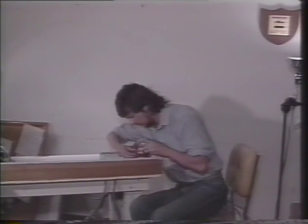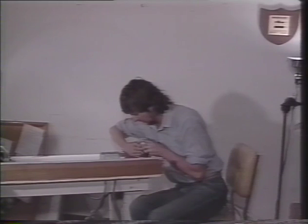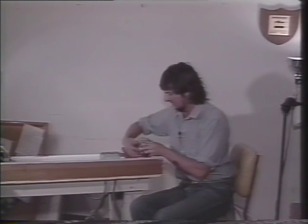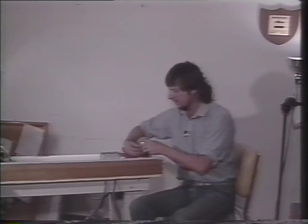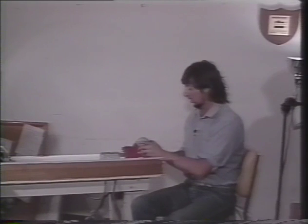And then we stick the anti-twist bolt through. It goes through a slot, and we have a nut for that, which we also, of course, don't tighten. This prevents the key blank from turning in the lock. Now, the object of this is not to unlock the lock, obviously. What this tool should do is grab the inside cylinder and yank it out, which of course would let us open the lock with a screwdriver if it works.